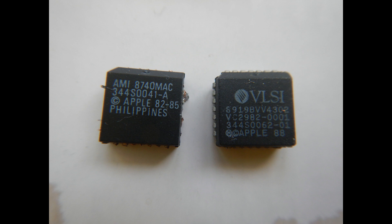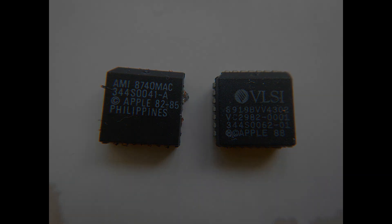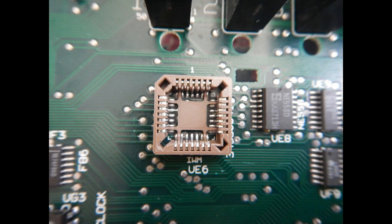Also, no documentation exists about these Apple part numbers. However, I could verify that the pinout is the same. By simple diode checking with the multimeter, I've found that the IIGS IWM is an NMOS chip while the Mac one is a CMOS chip, but this difference should not make any functional difference between the two. So I've soldered a PLCC socket on the IIGS PCB — I prefer this kind of socket with large openings on the bottom to allow easier soldering, whatever the method I'm going to use.